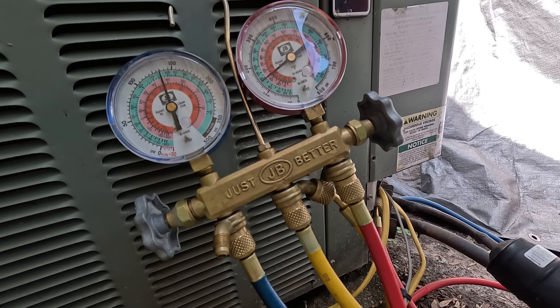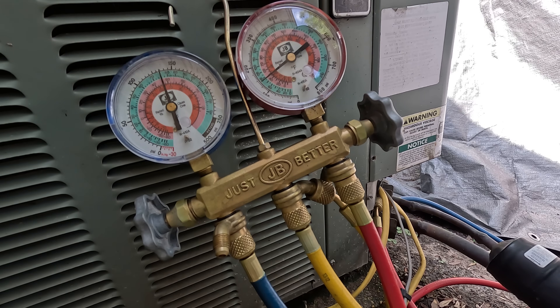We're going to give a lesson on how to check your Freon levels for an older R22 or 407C refrigerant unit. When you're looking at your refrigerant levels with the unit off, it's called a static pressure charge. When the unit is off, both the red gauge and the blue gauge should be identical — this is also called equalized pressure.